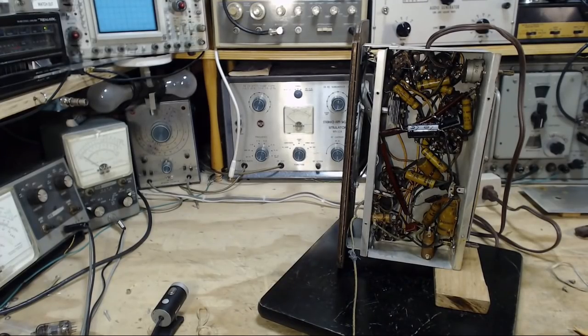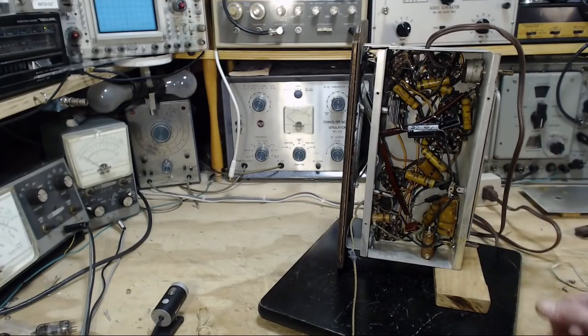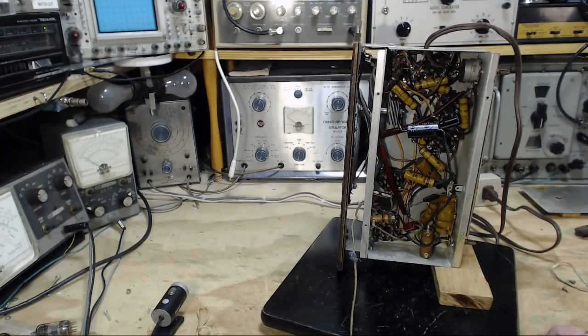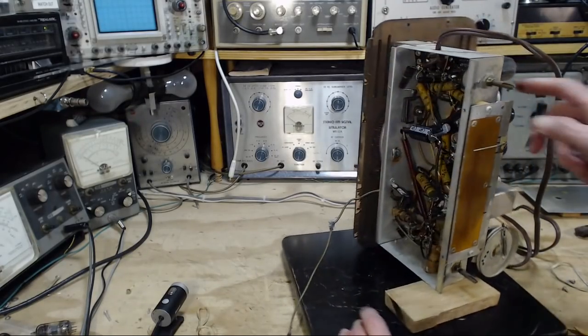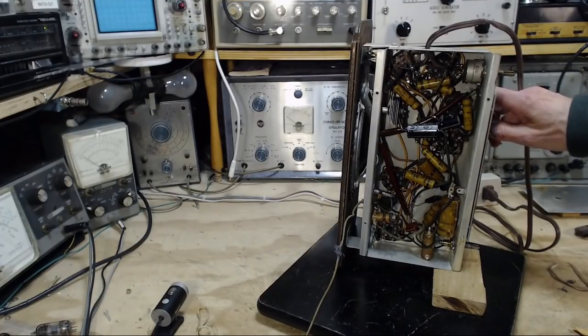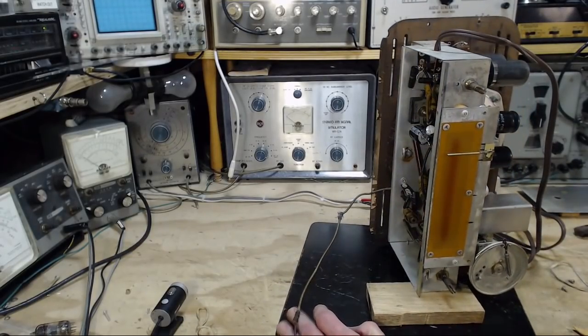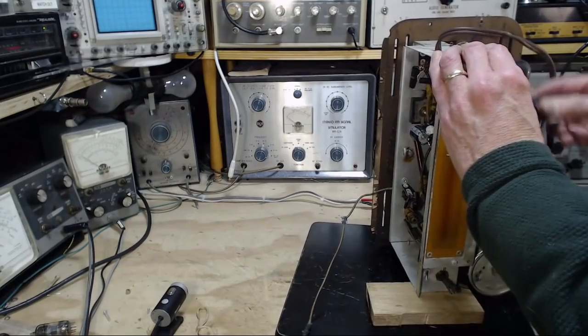Wow. So it's another case of a working radio full of original parts, except for this. And that crummy hum. That might be tricky to hunt down. I'm guessing it's just in the audio circuits and nowhere else. That means we could pull out the, probably this guy here. Do I have a tube layout chart anywhere? I don't think one showed up. I'm going to guess this will be the detector tube.